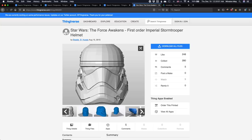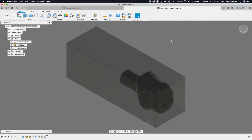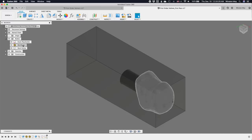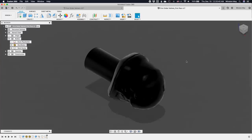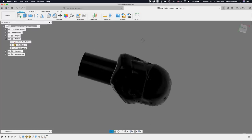I found a reasonable model online with proportions I thought looked pretty good and I pulled it into Fusion 360. If you're subscribed to the Carbide 3D channel, you'll have seen this setup before — it's the same one I used to make an aluminum Maltese Falcon statue and Buddha Yoda. I'm using the symmetry of my stock to rotate my part like a poor man's fourth axis. For those of you who've inexplicably not seen that video yet, here is the rundown. When you have an STL or mesh, the best you can do to machine it is to dump 3D toolpaths over the geometry and hope for the best.